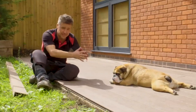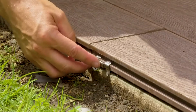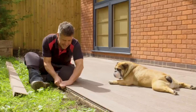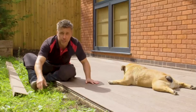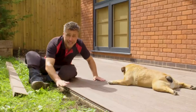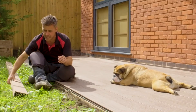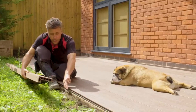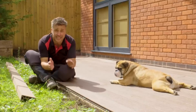One side of my decking is now complete. I've laid 15 planks here — it's had the approval of Sydney the bulldog. I've brought the planks all the way to one edge and used the clips to fix it to the edge of the frame, which anchors the edge down. I'm going to have a complete flush garden — top soil will be laid and then the lawn will be perfectly flush with the edge of my deck, nice and level all around. However, if your garden is lower, you can use a step-edge plank fitted onto the edge of the frame, coming down the front of your frame, and then continue with the same decking board on the face if a step is necessary.